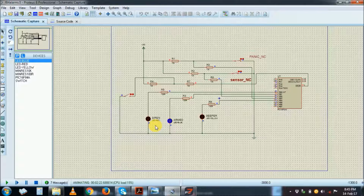goes off. So the on time must be longer than the off time. This is too short for simulation purposes. Otherwise you should make it in minutes. I've shown you where you can change the time in the flowcode program. It's shared in the folder. So until I come and do this, it will continue running on and off, and then reset.